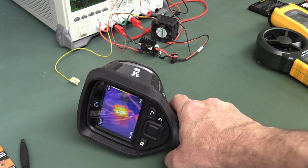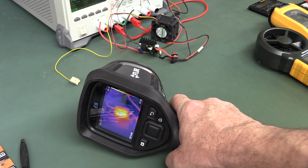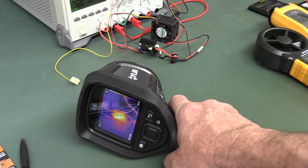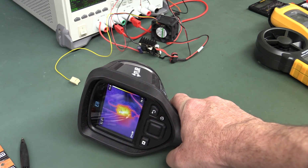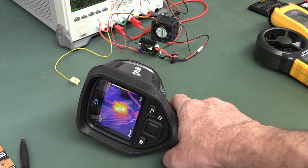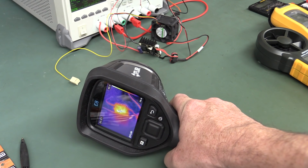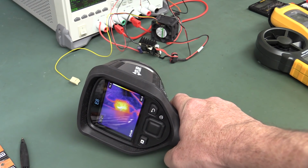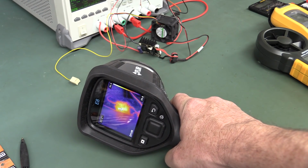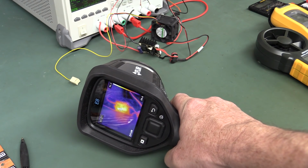And if we try and have a sneaky peek under like that, yeah, we've got the board on a bigger angle now, but like the case of the MOSFETs, for example, you get in there, let's call it 100 degrees C, but that's probably still okay. Yeah, I don't mind that at all, especially for the amount of power that we're delivering and that we're dropping. Yeah, it's going to do the business.